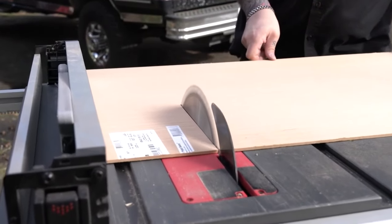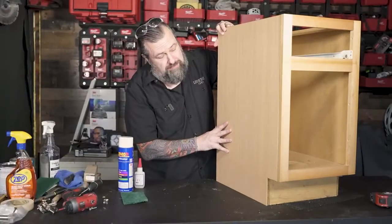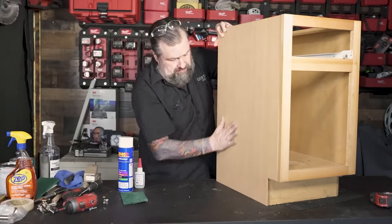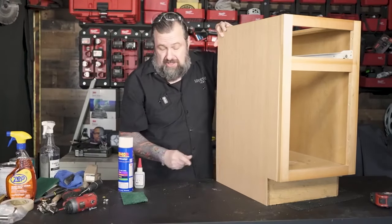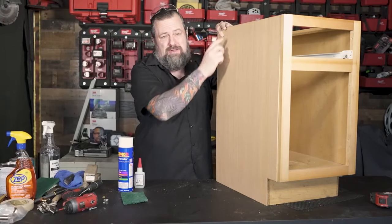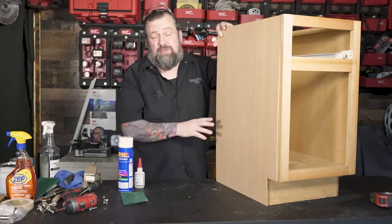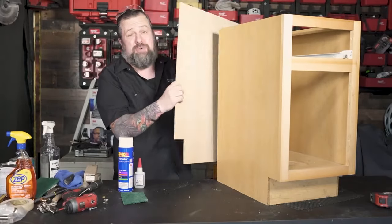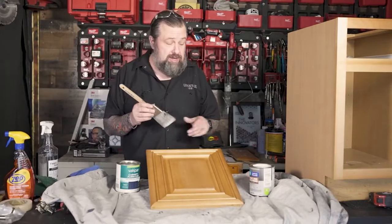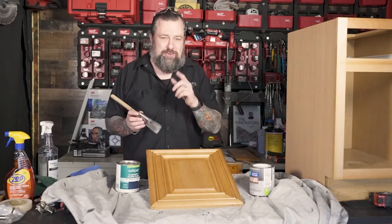Let's run to the table saw and cut that up. We've got that cut out — let's dry fit it to make sure it's going to fit right. It's going to look like a million bucks. A couple ways you can fasten this: pin nails don't hold really well because it's really thin, so adhesive is your best answer. Use construction adhesive or a fast glue. Now we've got this cleaned up, we're going to start working this primer in so we can let this dry and then start putting some paint on. I'm going to work from the inside out.